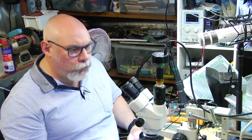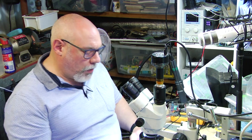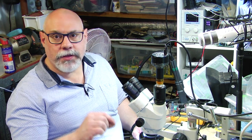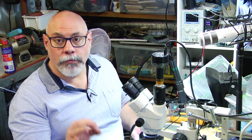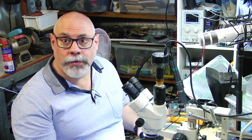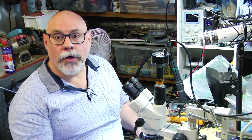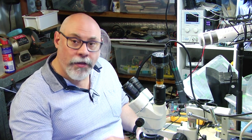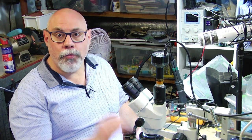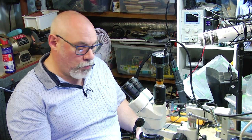So I guess one of the really important things that I always say about these is this isn't something that affects only some of these computers. If you have a Macintosh Color Classic and it hasn't been recapped and it's still working, you are living on borrowed time. They all leak, and they all will need to be recapped if you want to maintain them, if you want to keep them running.